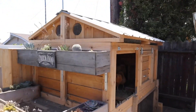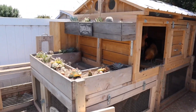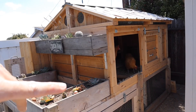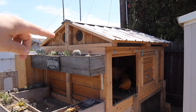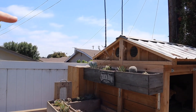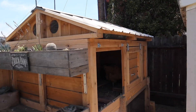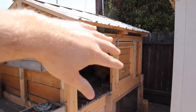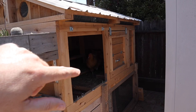So that's most of the coop. I'll post some measurements, but basically the entire footprint is 11 feet by 5 feet. The coop itself ends up being about 7 feet by 5 feet, with about 3 feet to the square part and about a foot more, so the full height is about 48 inches. I tried to stay at right about 4 feet — I didn't want it too high because of my fence line. Basically everything is a box — it's all frames, square, with the door sitting inside the opening of the frame.